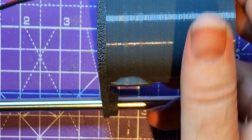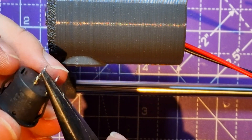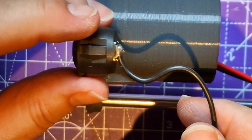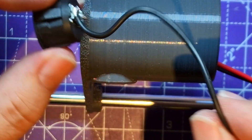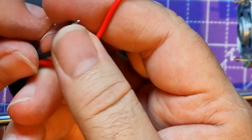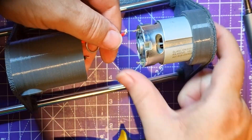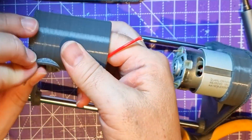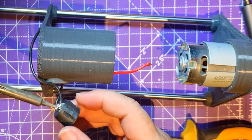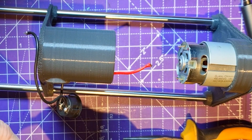I'm going to cut these wires down a lot so there's no way they'll touch, because I don't want a dead short - exciting sparks might happen! Right, I've cut those down, put some solder points on, and soldered a wire onto it. I've tinned these and cut them a bit shorter. I'll put the washer on first, make sure it goes over the black wire too, and tighten that up. Now I can solder the switch on - I really don't want a loose connection because this could be taking a lot of power.